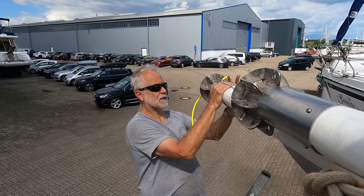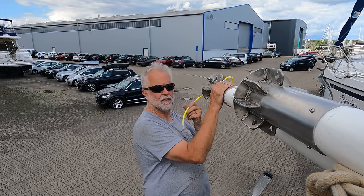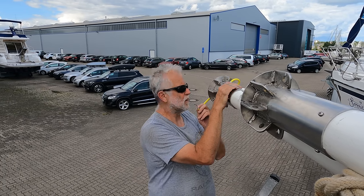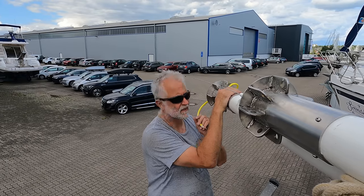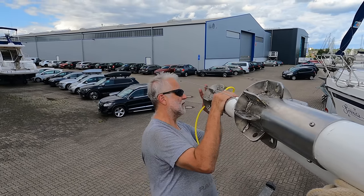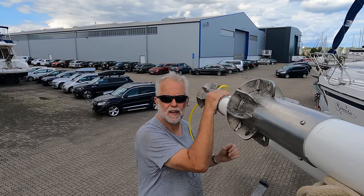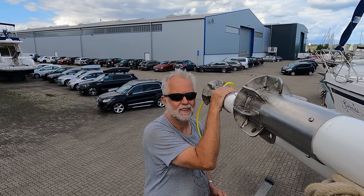And then this is the main mast, and we've just fitted this one and run the cable for the steaming light and anchor light up through there. A bit of a palaver getting that up, but we eventually got it through. It's a long mast, and we got it through. That's the important thing. And now I've just got to wire it up. I've got a couple of watertight glands, and then I've got to wire it up to the connector here for the top light. Getting on well.